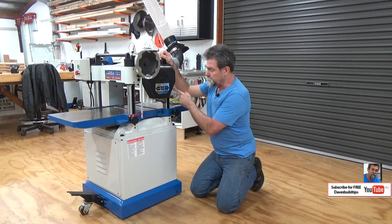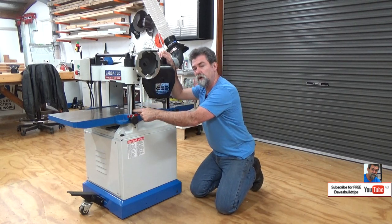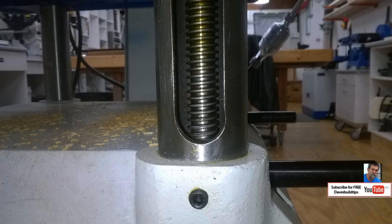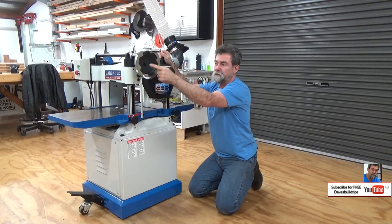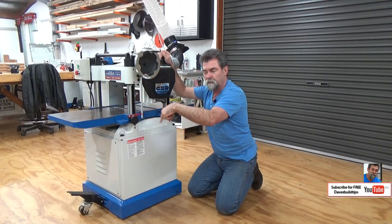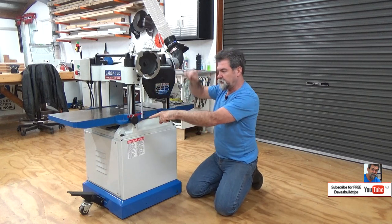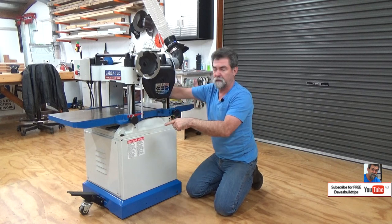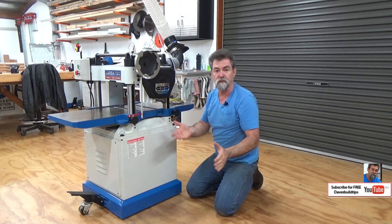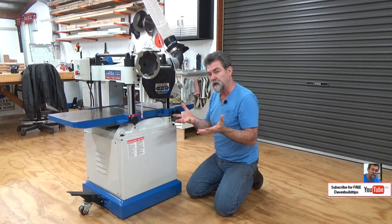For machine maintenance, they also recommend putting oil on the worm drives and on the outside of the pillars, since this table rises and falls. There's a pinion gear running against the worm drive, and this post is connected to the other three via a big chain underneath — like a bicycle chain. Turn one and it turns them all, raising and lowering them all at the same time. Very, very accurate.